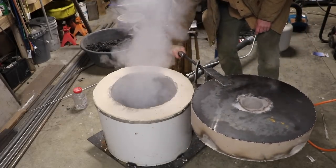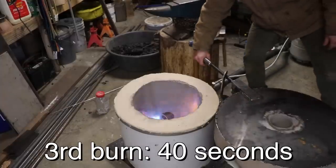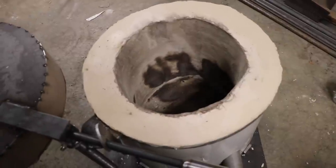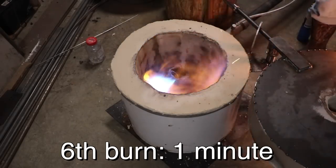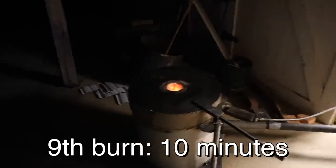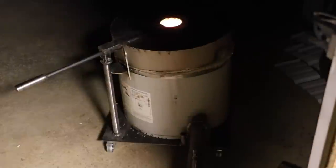That's a bunch of steam coming off of there. Starting to turn black in there with lots of steam. The area where the flame is coming out is drying out; the rest up here is still quite wet. I'm seeing a lot less moisture now — that one right there still looks a little wet. Not nearly as much steam that time. The perimeter is reading 2500°F. I think we have a successful furnace — 2500 is hot enough to melt cast iron.